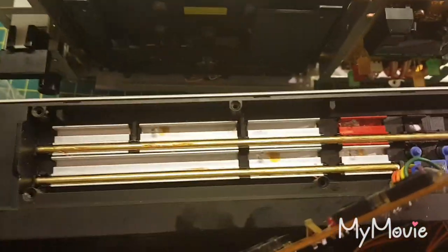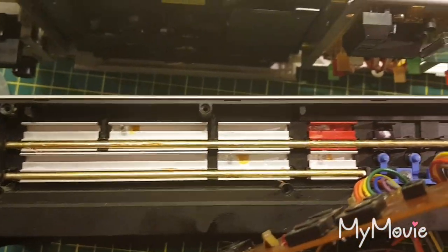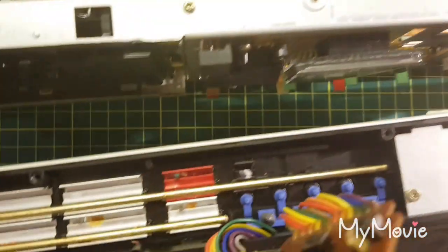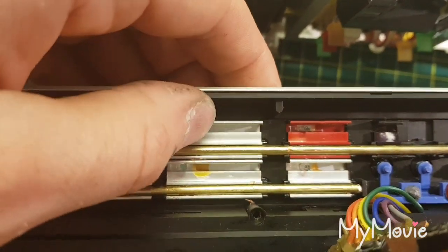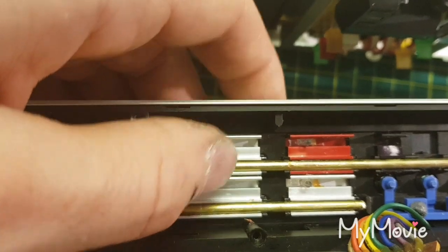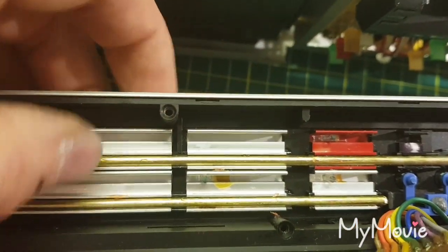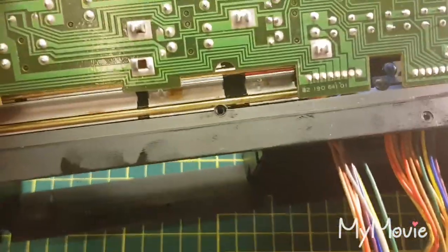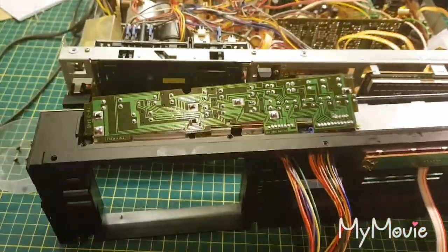There you are. That's the underside of those buttons. Just cleaned up some old grease, worked in some new grease, a little bit of oil, and they're now nice and free. So just 4 screws, that cover, there's the buttons. So now just carefully put it back together.